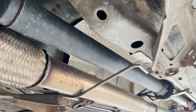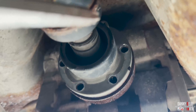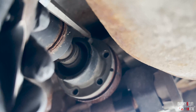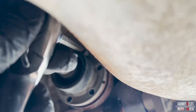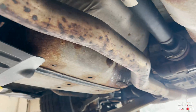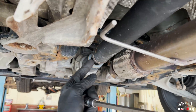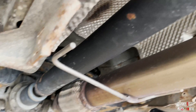So I'm going to get rid of the noise — it's like a bird chirping noise. A little tough to get in there. Got to put it in neutral, spin it, put it back in park. Now get the last two bolts off, then take these off. You can put like a ratchet strap if you don't have a buddy to hold it, so when it comes down it doesn't break anything. And then you might get a little fluid out of here, but nothing to worry about.